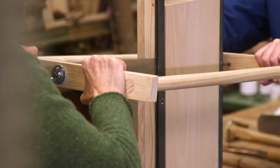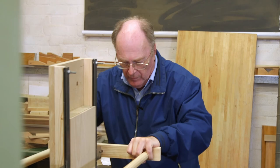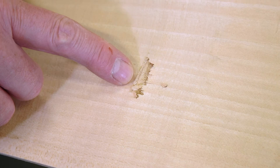In order to cut a two-millimetre veneer, two carpenters operating the frame saw would have had to have been highly skilled to achieve a uniform thickness. Only a slight change of blade angle would result in the saw breaking through the surface of the timber or going deeper into the plank from which it was being cut.